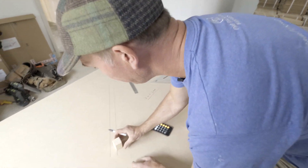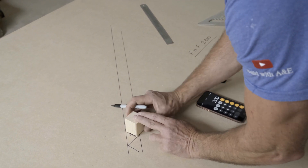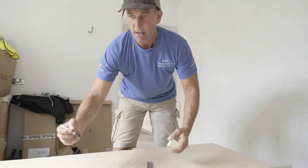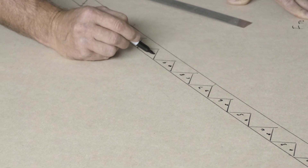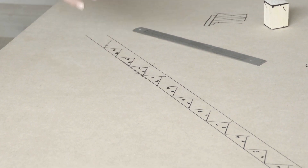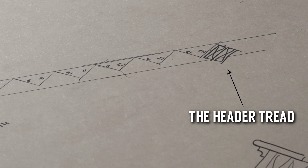I then get myself another little block like this and start drawing loads of treads and risers, so I can start to think about the staircase — any obstacles or problems I might encounter while building it. It gets me into that thought process. We need 14 rises, and if you count them out, we actually have 13 major treads. The reason I do this is so that in my head I know I've got 13 major treads and then the small top tread, which is the 14th.